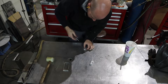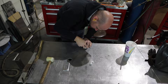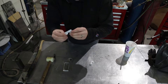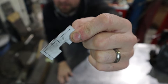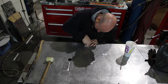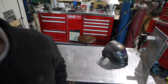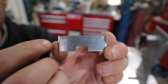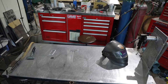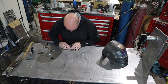I'm going to go ahead and actually mark out these crosshatches in the corners, and this is going to show me where to position them when I get ready to weld them together. I just put a couple center marks on the little crosshatches, and then that will show me where I need to weld each part together. You can see the center punch marks, and I'll just stack up each individual piece on top of those marks, and that kind of gives me the spacing that I need.